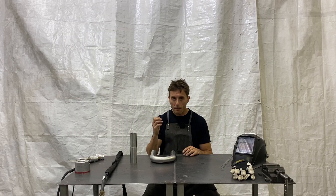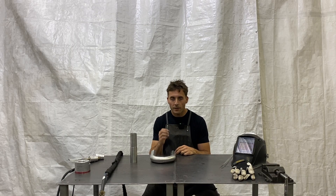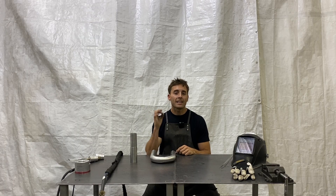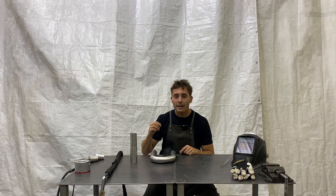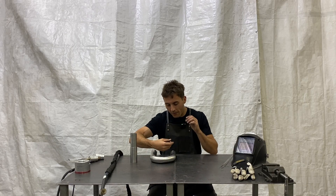I'm going to give you guys a pro tip right now — if you hear anything today, make sure you hear this. You saw that I set the amps on the machine to 40 amps, and that is very important. When I teach people to weld exhaust, I harp very diligently on finding the perfect target amp. When we're doing butt welds, I shoot for 35 or 36 amps, and what we do is teach to just go wide open on the pedal — that's our aim here.